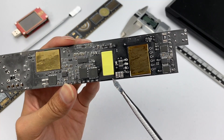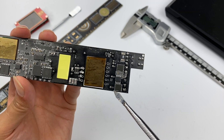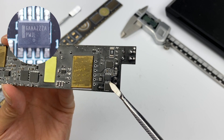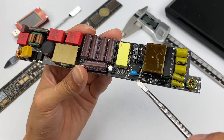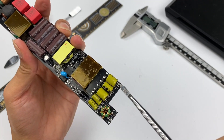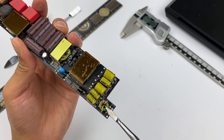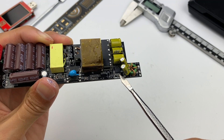The output side has a synchronous rectifier chip and two synchronous rectifier MOSFETs. The chip comes from ON Semiconductor, module NCP4306, and the two MOSFETs come from Infineon. There are two Y capacitors and an optocoupler on the front side. Five electrolytic capacitors from Yongming and an inductor at the output compose the filtering circuit, which makes the output voltage purer. A synchronous rectifier chip is located under the output filter capacitor.